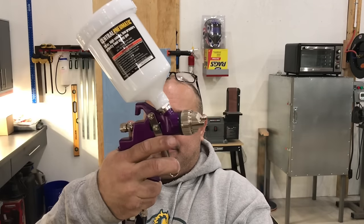Right now I'm running about 30 pounds of air. We're spraying water, so it doesn't take a whole lot to atomize that. The viscosity of straight water is like 17 to 19 seconds, depending on what viscosity cup you use to measure specific gravity. I think it's a Zahn #2 cup — runs about 17 to 19 seconds. So we'll do a little pattern, spray it on the part here and show you what it should look like when you get an overlap.